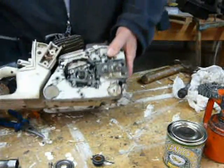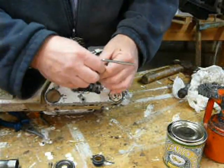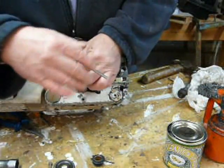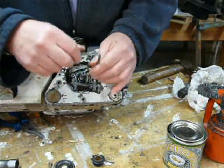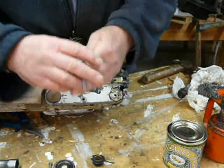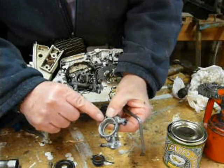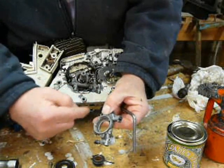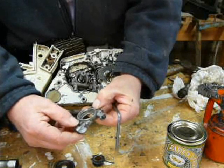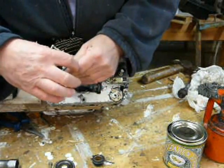So then we've got two bolts. Don't wind one down really tight and then put the other one in — it's like with most things in engineering. If you've got a case with six bolts, put all six bolts in and wind them down a little bit so that the pump is just pulling in parallel. Remember that on the back of the pump there's a raised area, and that sits in a groove in the casing, and also in the relieved area provided by that raised area on the bearing. That's that.